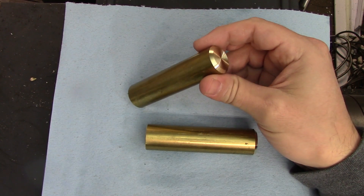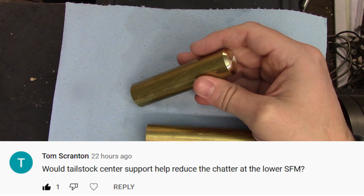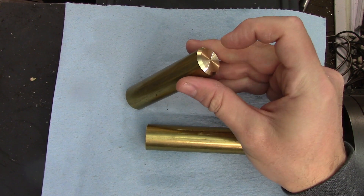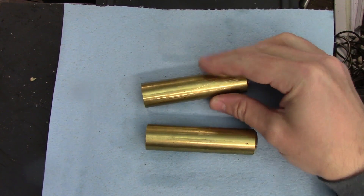The first question came from Tom Scranton. He asked: would tailstock center support help reduce the chatter at the lower SFM? That's a fantastic idea. Let's go ahead and try that — I'll put a center hole in here and get set up with my thread relief.